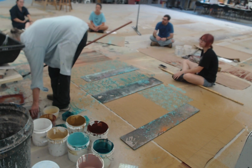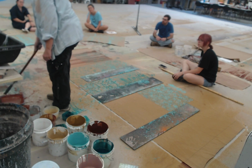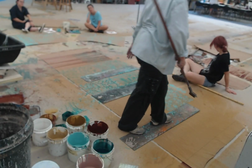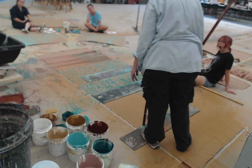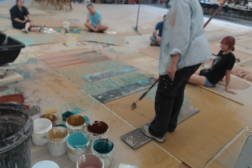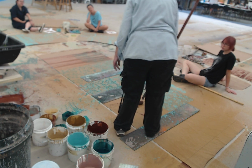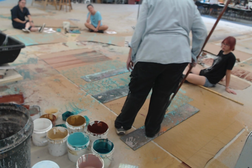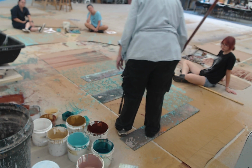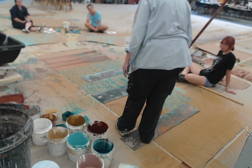So when you work with a roller, you can work with it so that it is just doing a killer job and laying the paint on really, really solid. Or you can do what we call a dry roller technique. So when you're doing a dry roller technique, you want the roller to skip. Okay? So that I'm actually creating some texture.